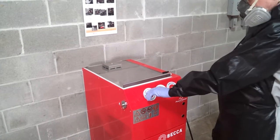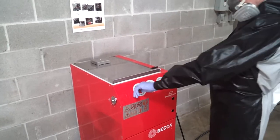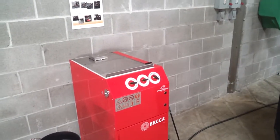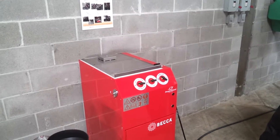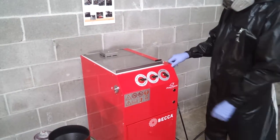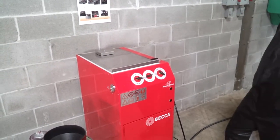Turn the power clean valve on and then the solvent selector to use solvent. Next, turn on the wash basin valve. The time frame will vary based on the color being cleaned — longer for most reds and whites and for guns with dried paint.